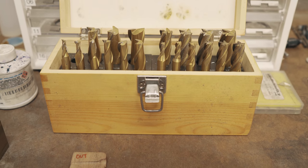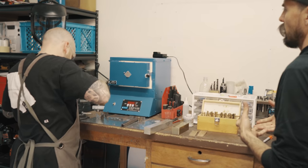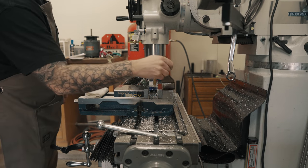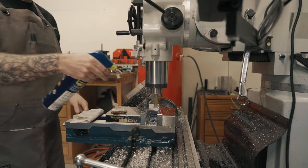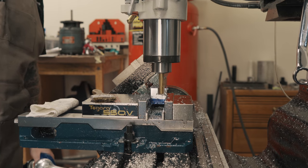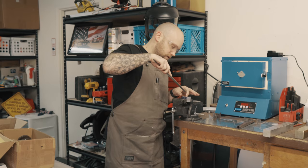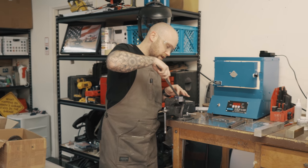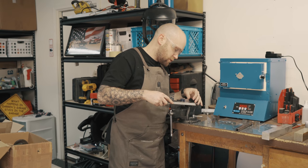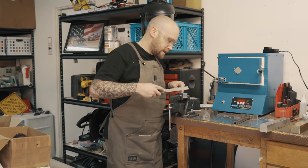So is there a steel that you use to create whatever you're going to create and then you harden it, and then it's tool steel, or do you buy it already? How does that process work? Either way. Heat treatable steels that you could do in a home shop would be like A1, A2, W1, W2, and then O1, O2. The letter represents how it needs to be quenched or cooled. So A1, A2 is air cooled.